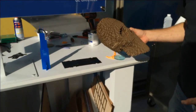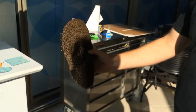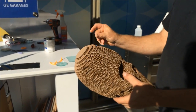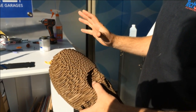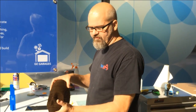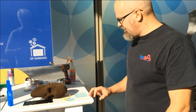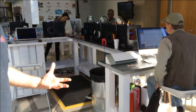Autodesk has a piece of software called 123D. Yeah, I've heard that one. Right, 123dapp.com is amazing software. It not only will let you design and build three-dimensional objects, it's all free. You can then run it through a Make program to do slicing. You can run it through a CNC program to actually create G-code to cut it on a CNC machine. All of that is free. We're trying to get innovation into everybody's hands.